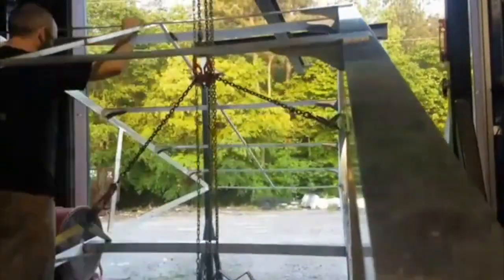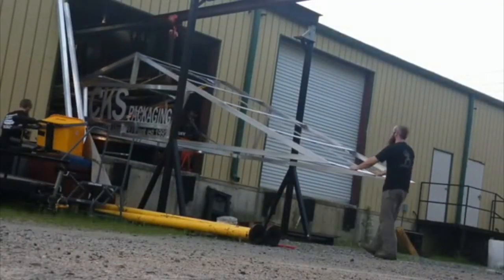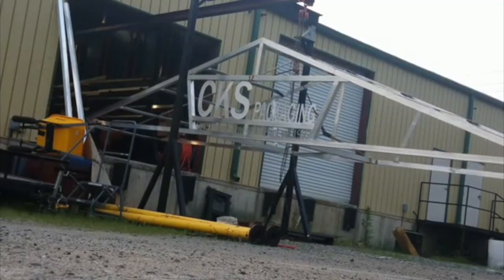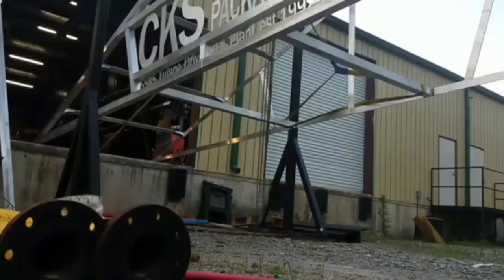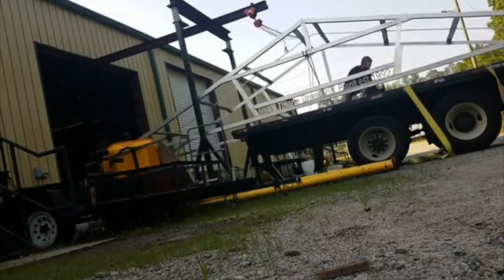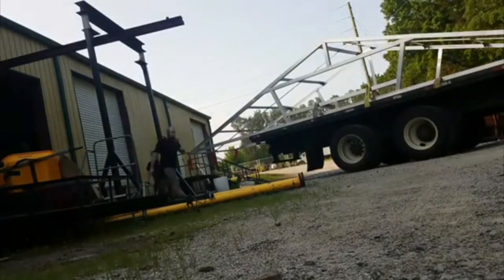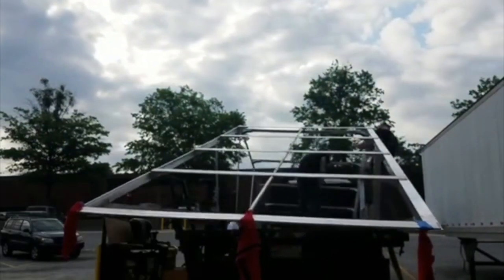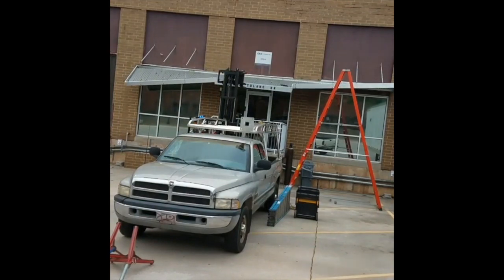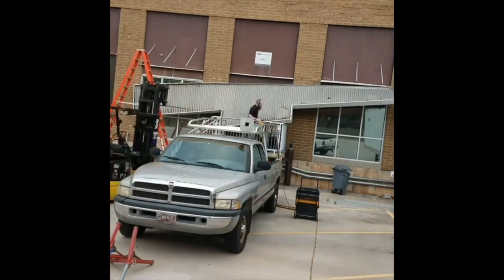The spiral staircase is a center post with plasma-cut treads that slip over it, all clocked evenly, with uprights and a handrail going up. It's going into a home around here — must be a pretty tall ceiling for that thing, it's a monster. The whole build was really easy — it's all simple geometry. Each step was about 30 degrees, so every third step it was perpendicular to what he needed. You put on three steps, turn it once, another step level, twist it 30 degrees — very easy to build the steps. The handrail was the worst part.